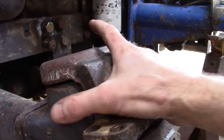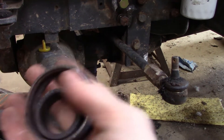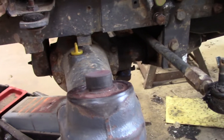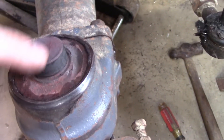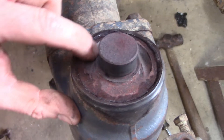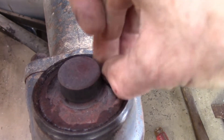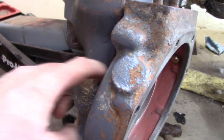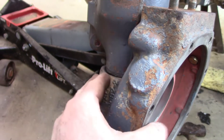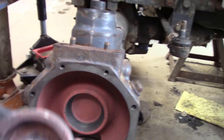What I found on the top here was my bearing — it was completely shot. There were maybe four or five balls left in there. I think you can see in this top kingpin that these grooves were actually caused by these balls scraping down in there. We've torn all this apart, replaced the seal that goes inside here, and there's also a roller bearing down in here that supports the weight. Those have already been replaced and this piece has been popped back on, so we can put our new bearing inside of this housing.